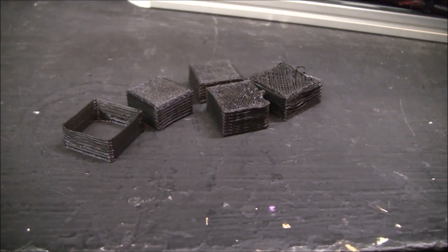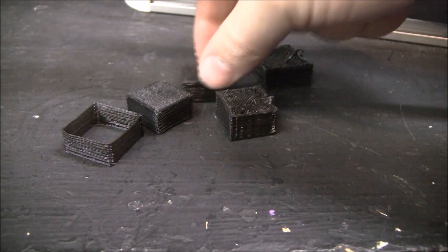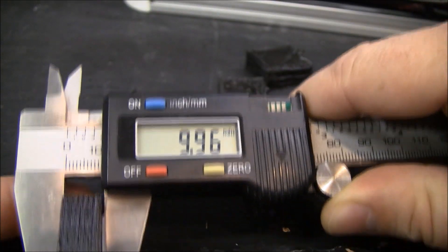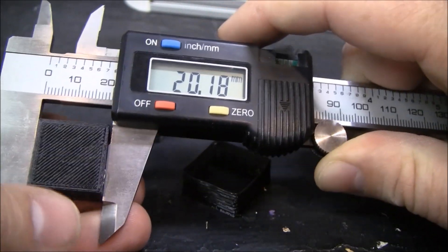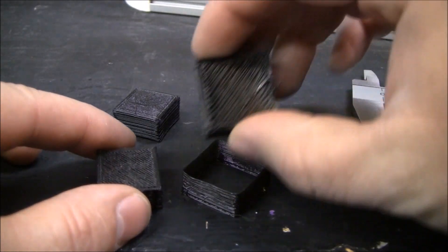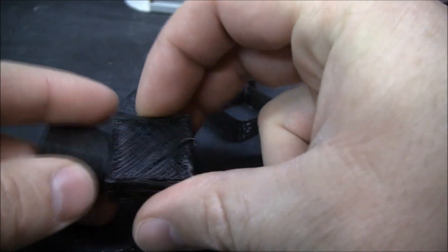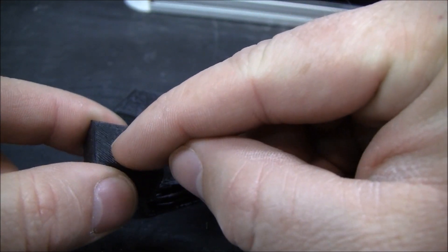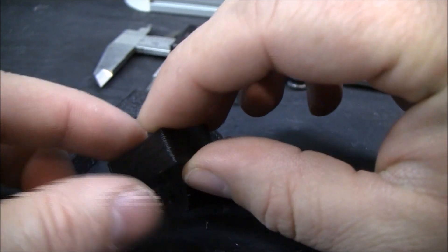For your first print, you're going to want to search for RepRap calibration objects. One I've used a lot is the 20 by 20 cube. You're going to want to check how well your machine is working — it should be 10 millimeters high and 20 on each side. You can see I eventually got it calibrated down pretty well. I also printed some pretty horrible ones — notice how this one is scaled wrong. In the firmware, I didn't have it adjusted right. It's really important to get this figured out so it's using the right amount of material and printing the right size. You can see there's a thin wall that you can use to figure out what's going on.